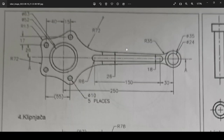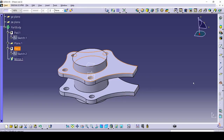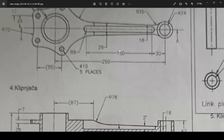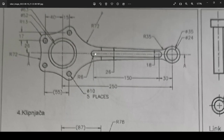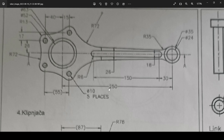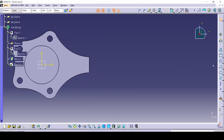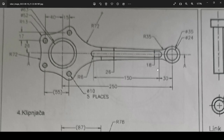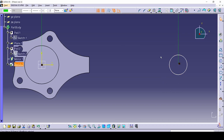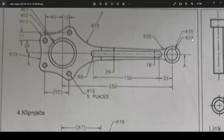Now we want to make this part — it's going to be a bit complicated, so stay with me. Let's get into this face and start from the top. We need to look at this view. For the length, I think we go 250 millimeters here, draw the circle, make everything here, then delete the circle later. So h has to be 250. The circle is Ø35.